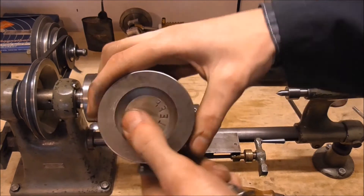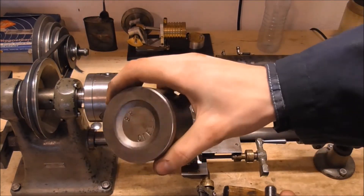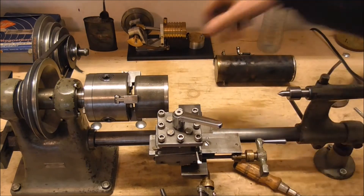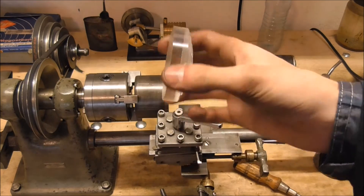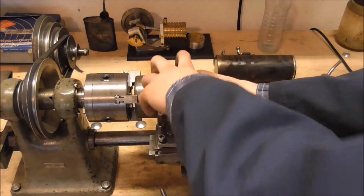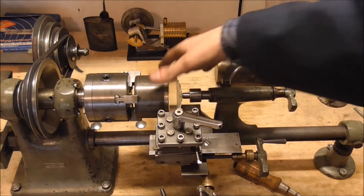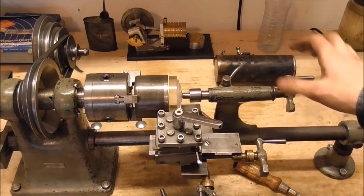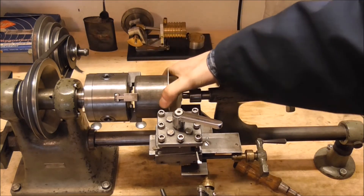This is some kind of punch press which was used to mark screws — I just found it and took it. When we put this on here, of course, it's just going to fall off, so we need something to press up against it. This is some acrylic. I've got a center drill in this side, so I'm just going to wedge the part in here with the tailstock, just like that. Now we need to get it running true, and by exerting pressure on the tailstock, the friction in between the parts is so great that it won't move.